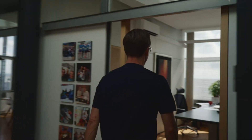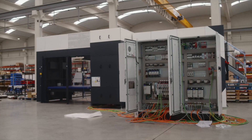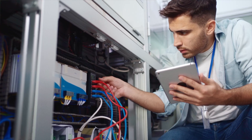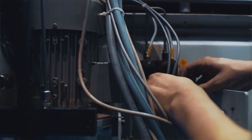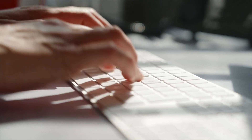Most motion equipment is tucked away in cabinets — servo drives, IOs, PLCs, IPCs, safety devices. Engineering and manufacturing these control cabinets is a massive undertaking. Wiring inside these cabinets is a tedious task, and the cables connecting the control cabinet with the point of motion carry so many wires that need to be effortfully shielded. Motor cables, encoders, safety and other signals quickly add up to several hundred wires.